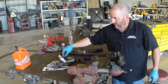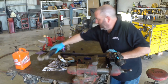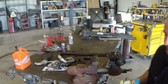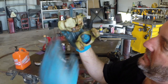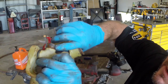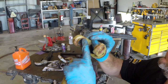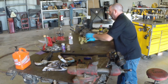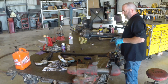It's not the end of the world, it's not that hard. There are times where rust can make life more difficult but that one was pretty simple. Now this is my old one — both of these yokes are splayed, actually twisted, so neither one of these yokes is any good. I just bought this mower and it had not been greased in a long time — the cups were completely trashed, the yokes were trashed. These are from Tractor Supply, about $80 a piece, and u-joints run about $25.